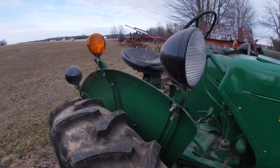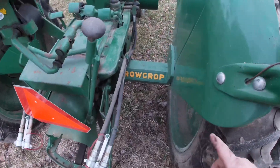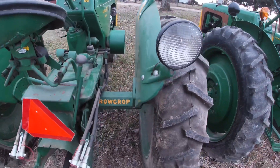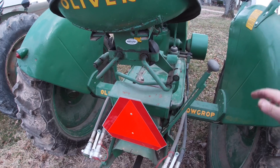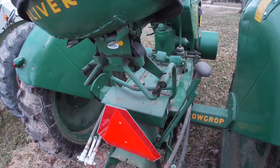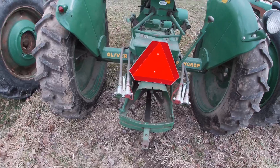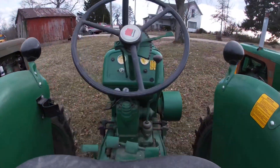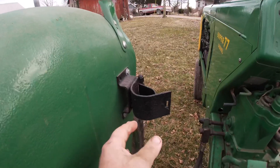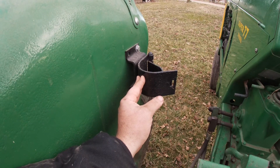Again all new lights all the way around — warning lights which I haven't wired up yet. I got new wiring run to the fender but haven't had time to finish it. The seat needed rebuilding too, which I did several summers ago. It now has new steering wheel and gauges. Everybody sees this holder and wonders what it is — they think it's a grease gun holder, but it's a hydraulic cylinder holder. Back when hydraulic cylinders were very expensive, guys would take them off the implement and move them back and forth, clamping the cylinder here so they always had it with them.